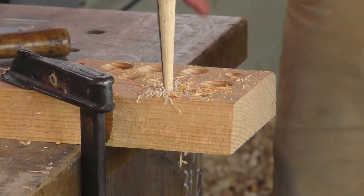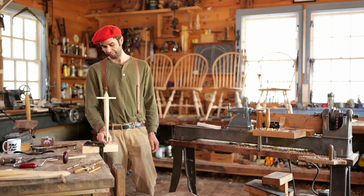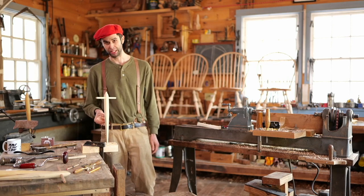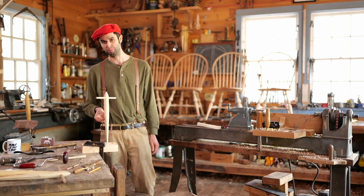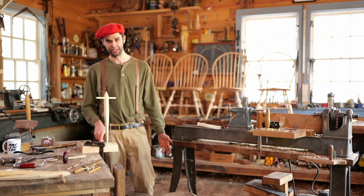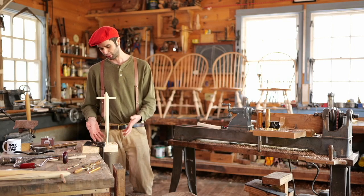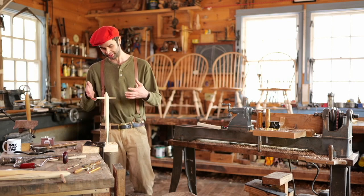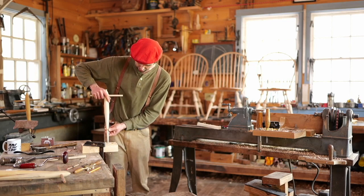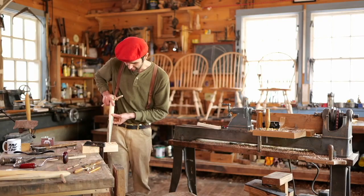It's not critical that this thing cuts consistently along this entire length, because in real life, all you're going to be doing is cutting in certain places. And especially if you have an adjustable blade, you're only going to be drilling one size hole one day and then another size hole the next, so you could adjust it in between those times. It's certainly more convenient if you just pick the tool up and it's cutting the same along the whole length. But you can use a reamer that isn't perfectly tuned up like this, especially if you have an adjustment screw in it.